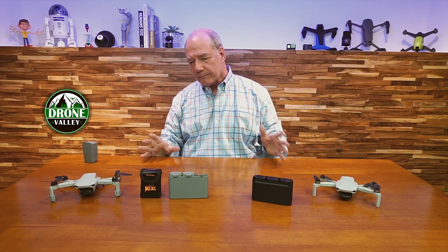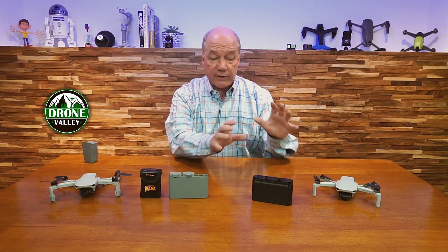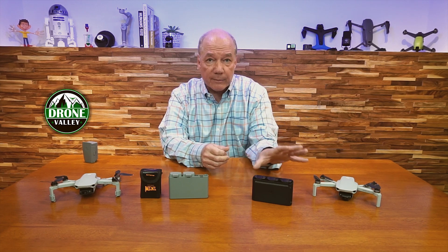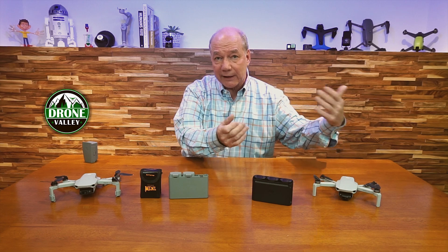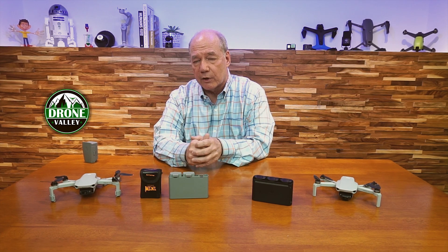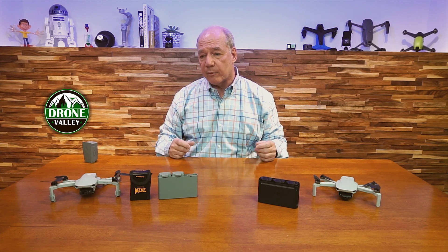You could pick on DJI and ask, how did they miss this? Well, the original Mini used lithium-ion batteries, which curiously don't require auto discharge — the Mini 1 batteries would sit in the hub fully charged and be happy. Lithium-ion batteries are a little bit safer in a fully charged state than lithium polymers. DJI likely took a lot of the programming from the Mini 1 and transferred it over to the Mini 2, and somewhere along the line somebody missed the auto discharge function.